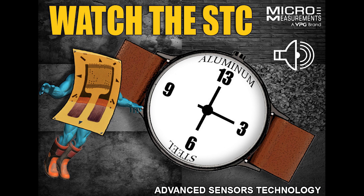So to summarize for this customer on carbon fiber: it sounds like 00 or 03 could be good choices depending on the exact coefficient of thermal expansion. And either way, for the most accurate results, he should put the gauges on the carbon fiber and generate his own thermal output curve. Trust but verify — verify that polynomial. If it doesn't behave exactly like the package data, you need to adjust and use that to correct your data.